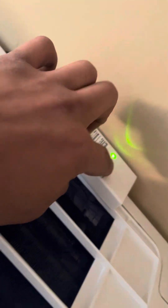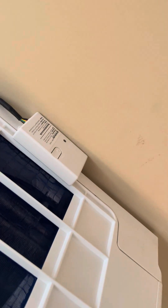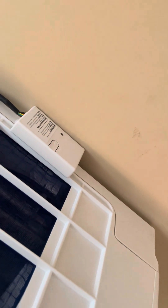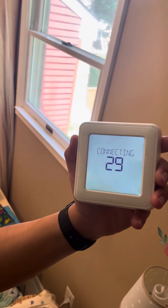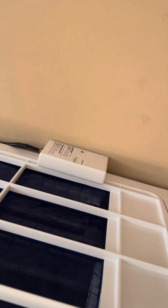We'll click on the connect button, which will then start to flash green. First it's amber, which means please wait. Then it will turn into green and slowly blink. Now it will connect — it's going to take 30 seconds, and the flashing light will start to increase speed. When it increases speed, it means it's in pairing mode.